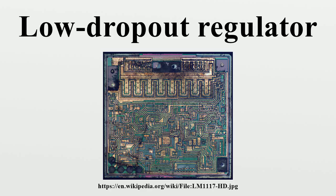In an ideal LDO, the output voltage would be solely composed of the DC frequency. However, the error amplifier is limited in its ability to gain small spikes at high frequencies. PSRR is expressed as follows. As an example, an LDO that has a PSRR of 55 dB at 1 MHz attenuates a 1 mV input ripple at this frequency to just 1.78 microvolts at the output. A 6 dB increase in PSRR roughly equates to an increase in attenuation by a factor of 2.